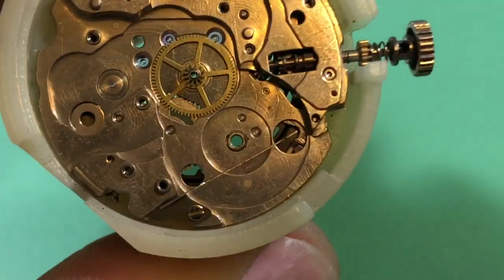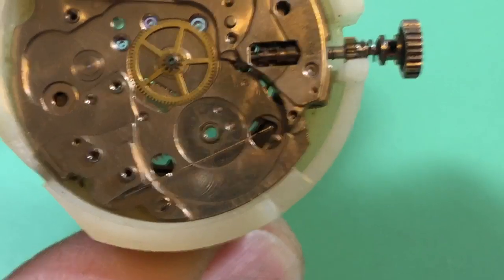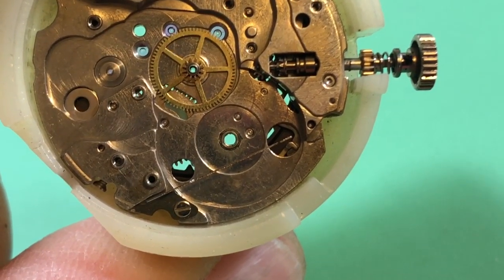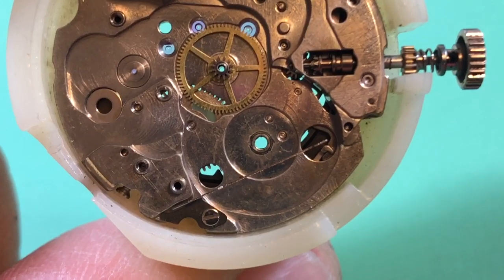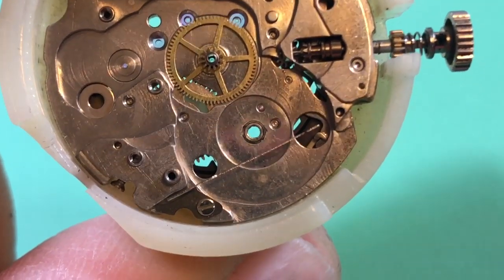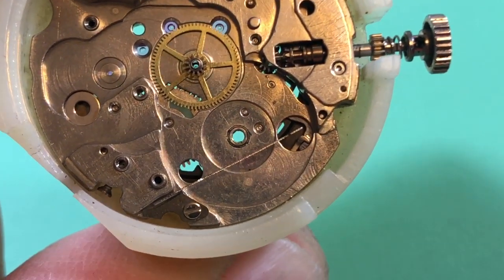Okay, so there's the lower mainspring arbor port. You can see that ring of crud around it right there. And you can see that it is ovaled out from your perspective down to around the bottom left. So, you know, it's the usual thing. Yeah, he was active and your lower mainspring arbor port is worn. So we're going to machine that out and install a jewel. And so that'll be a permanent fix there.